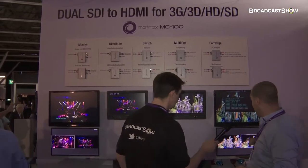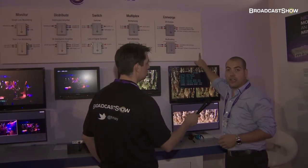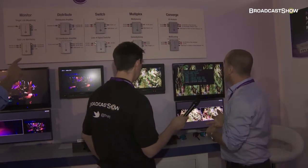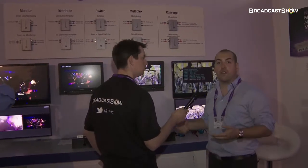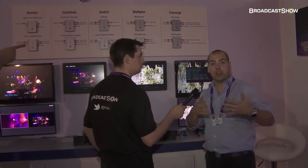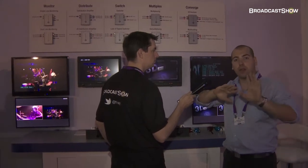And finally, for the 3D processing, what we do is we take a left and a right image and make it broadcast-friendly side-by-side or top-bottom. We also support frame packing on HDMI 1.4a because this is an HDMI 1.4a compliant device. We also have analysis modes which include anaglyph, difference, and 50-50 — those are for stereographers to know if their images are properly converged. If they are not, with these hardware buttons, stereographers can converge and diverge the images, vertically align them, and flip and flop them if using a mirror rig.